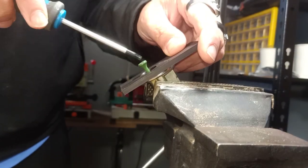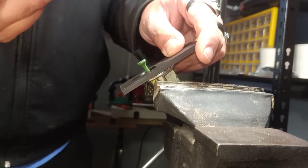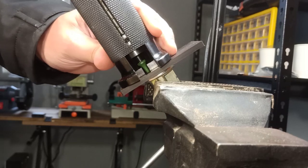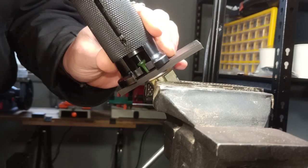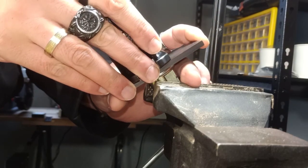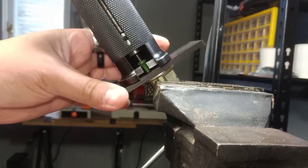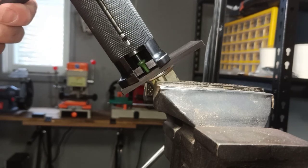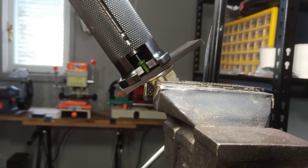Taking our plate, I'm going to stick it over the face of our lock and align it so that the core is in the centre of this plate. Then we're going to hook our unit over - if I turn on the angles you'll hopefully be able to see. Sometimes you might go a little bit too far in with the screw, so I'm just going to back it out a fraction so that I can actually grip onto it - probably best to leave the last thread on the screw sticking out. Now I've got that hooked over. I'll tighten it up just enough to hold and make sure we're all lined up. Core in place, our screw is fixed in there. Now I'm just going to take a shifter, put it on here, and we're going to start tightening. You should see the centre of that bell will start pulling the core out. Because we've got the face plate covering it, all the force is going to be applied to the front of the lock.